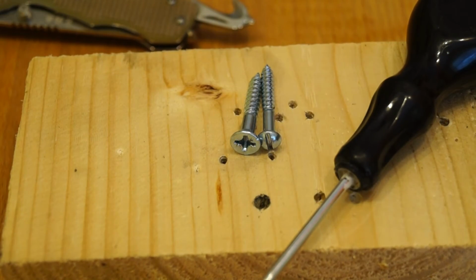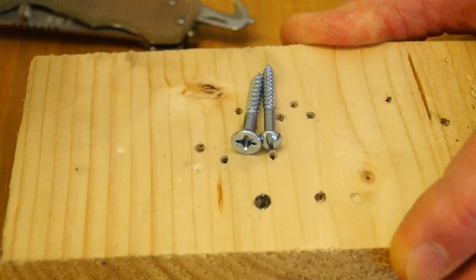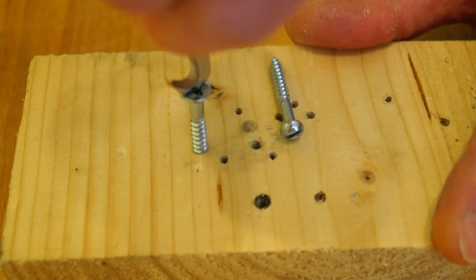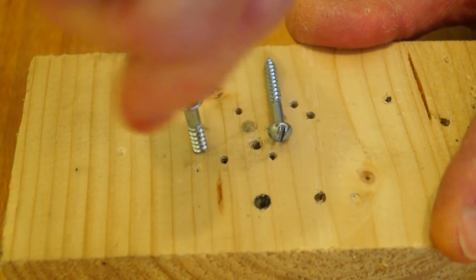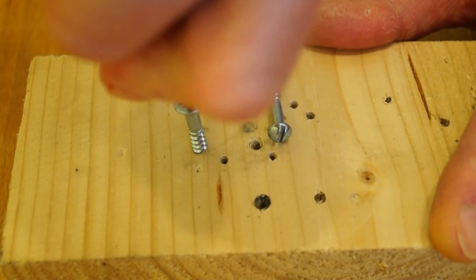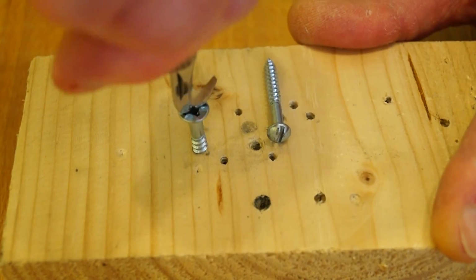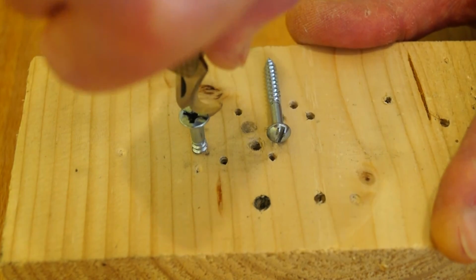All right, let's try getting some screws in, guys. Make a hole. We'll start with this large-ish Phillips screw here. Pop it into the hole. Get the driver in there. It's a little unsteady at first. Here it goes. But the only problem I have with these non-locking driver bits is if you use a lot of pressure on them, they will actually collapse. So you do have to be a bit careful while using these little fellows. That's not done too bad so far. I don't think this screw head's particularly too good because I've used it a time or two and it's getting a bit rounded off.